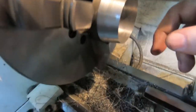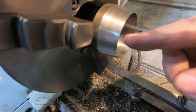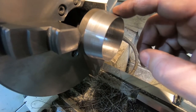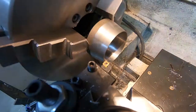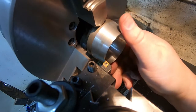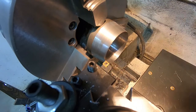Okay, that's pretty good. It's not sharp yet. I'm going to change the angle on the compound to more like 25 degrees, something around there, and then do the final bits there so the actual chisel edge isn't quite so super thin and fragile. I think that's the proper way to do this. I'm not a bladesmith. I just watch videos like everyone else. Yeah, let's try this out.